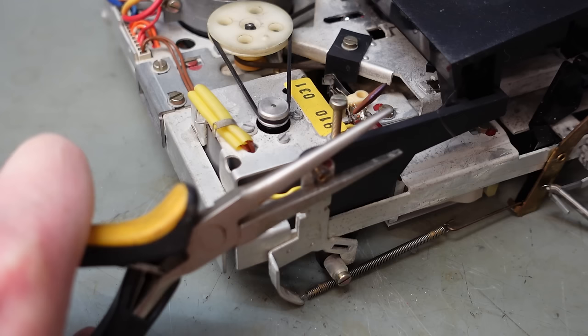Yes, annoyingly, I can feel it in this end, where the brushes are. It doesn't look like this motor comes apart very easily, not without destroying it, so I may have to drill a little access hole. I'm thinking normally these motors don't have actual ball bearings, just a brass bush, so we'll try it. Oh well, that was lucky. Gonna get me a lottery ticket now.